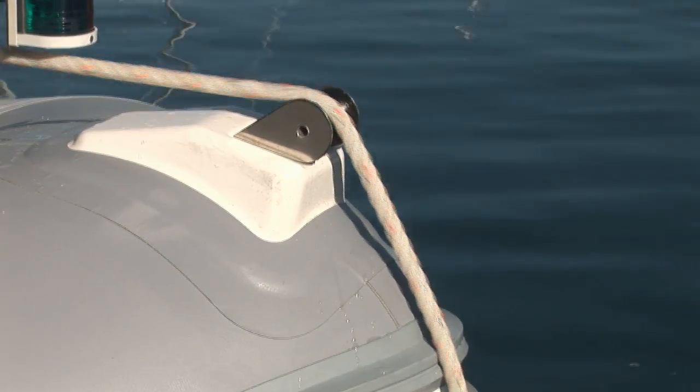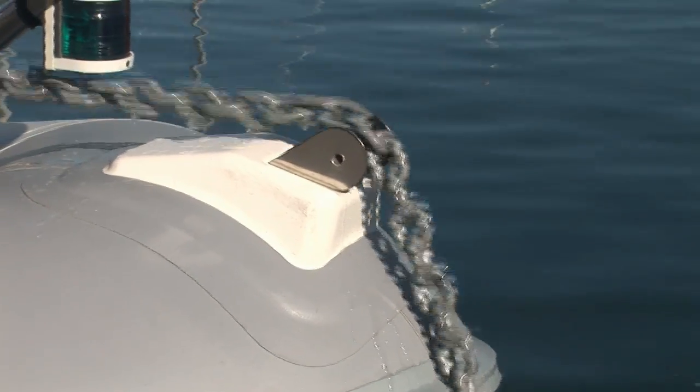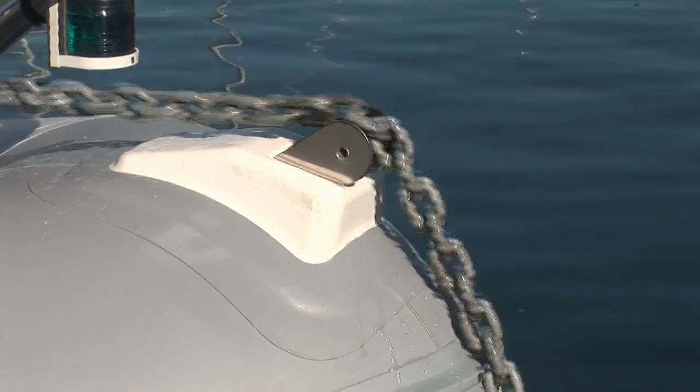So Chuck, what about using a rope-to-chain spliced rode on boats that don't have a windlass? I think that's a great idea. It's secure with no mechanical parts to fail or shackle pins to unscrew. Plus, it passes over anchor rollers and through chain pipes with less hassle. I'd recommend it for anyone that uses a combination rode.